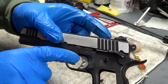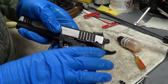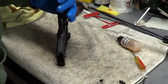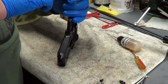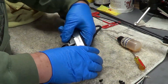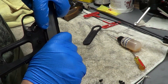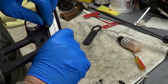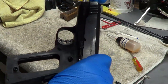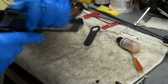Now I have to get this piece in here without getting an idiot scratch. A lot of people want to push up instead of straight down. It makes it easier when there's no spring tension, but I have to do it with spring tension. So I'm going to grab this, hold this back, line this little mark right up there, and then come straight down and push straight down — not get your glove caught — then push it in after it's lined up. And you're good to go.